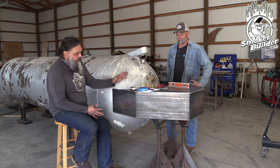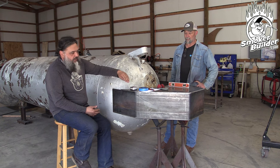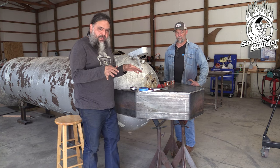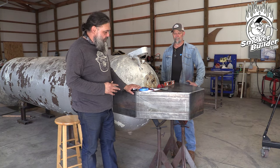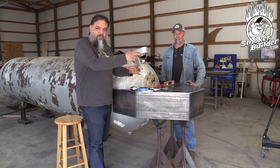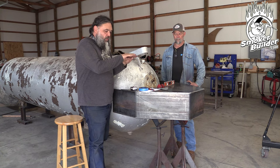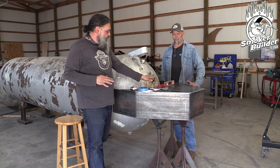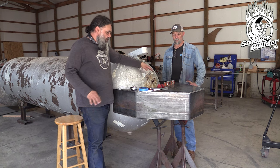When I initially started making these ends with Frank, I was really adamant about keeping all my surfaces really flat. I had welded in a stiffener — a piece of flat stock — that went across, clamped it down, forced that sheet to be flat, tack welded it in place, and then began assembling my dimensional piece. What happened is it did remain straight, but as I put heat on there with the exhaust and welding, it warped a little bit and went concave. And when that happens, it'll start collecting water between the belt and the stack, and we don't really want that.